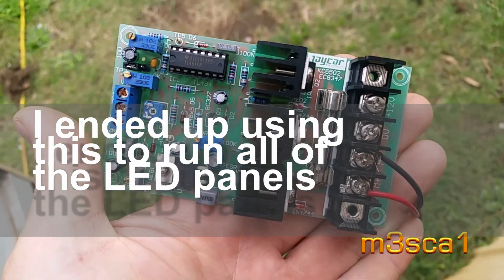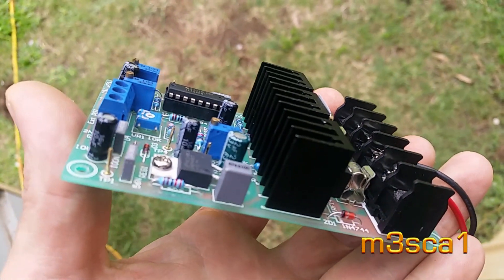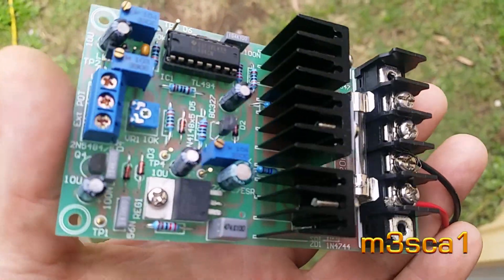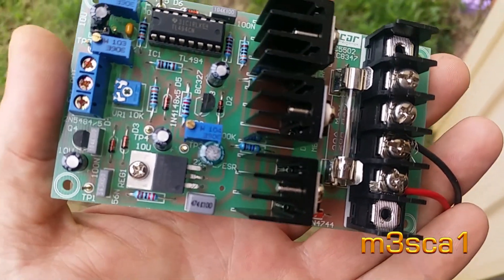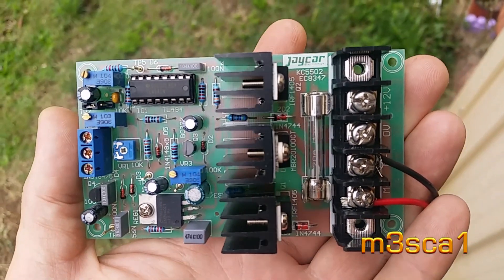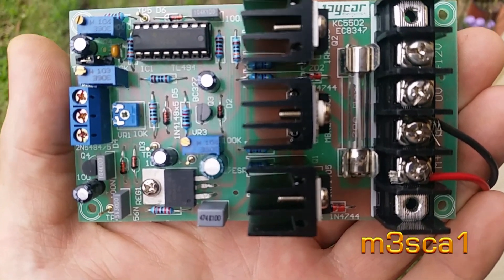That'll give me full color temperature control by dialing down the blue. I'd like to have something else to control the warm whites; however, at this point I might just put a dropping diode or something there that brings it down to about 11.5 volts. There's a really good MyGrow video on the subject of these COB panels — I'll link it in the description if you want to know about using them as grow lights. There's a really good review testing the power, strength, and stuff like that.